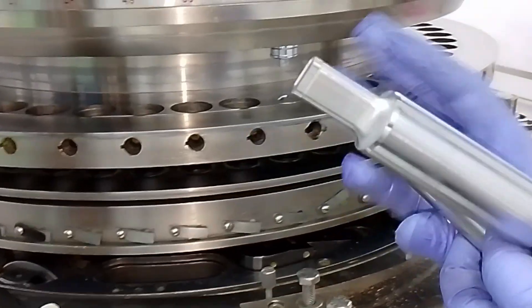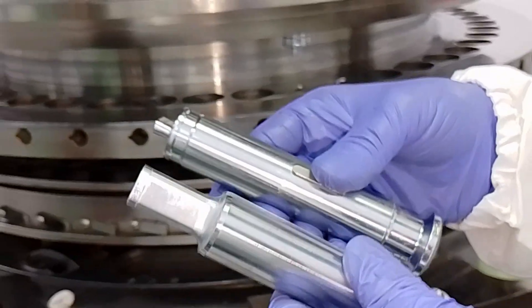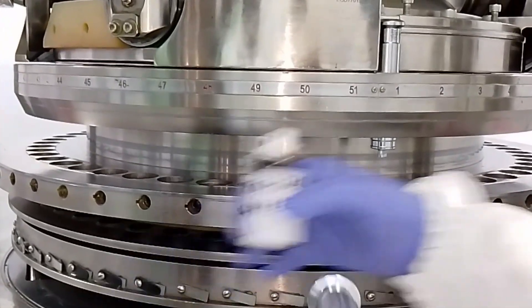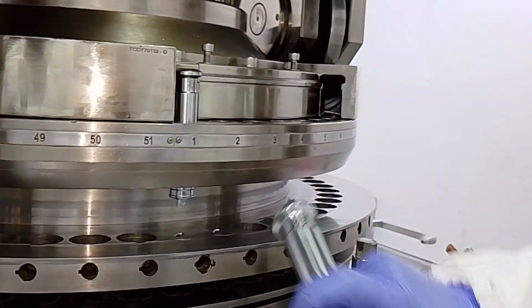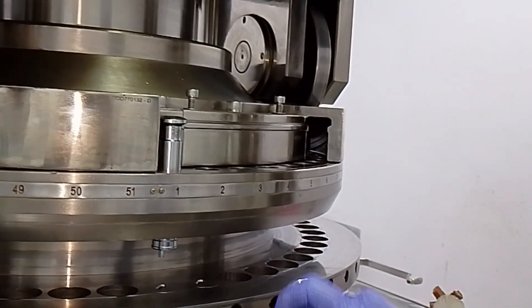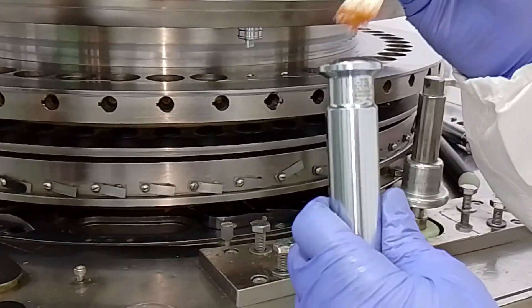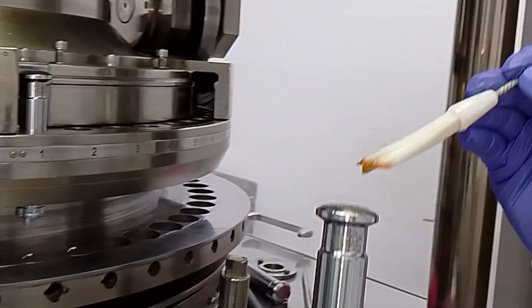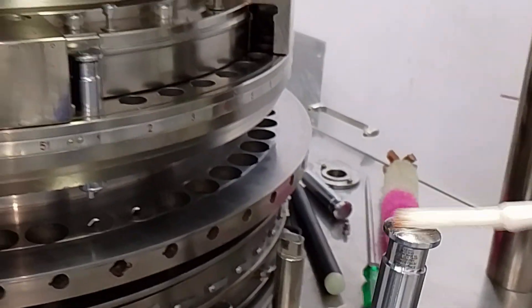After setting the die, we will check the alignment one final time — is there any clicking sound? After this I will show you the lower punch. You can see there is a difference between the upper punch and the lower punch — its tip is a little bigger. The same procedure has to be done. Apply oil on the barrel and rub it well with your finger. After rubbing, apply grease on its head. Remember: whenever you apply grease on the head, take precaution that the grease does not get on the barrel. Only the head has to be lubricated.